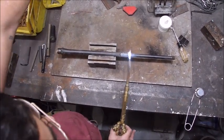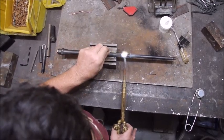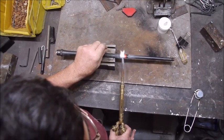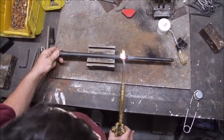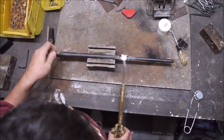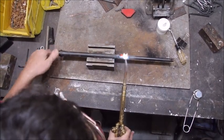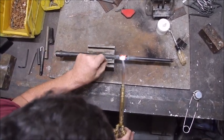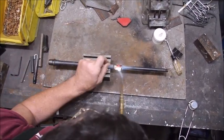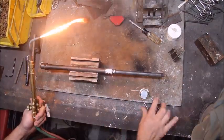So now I'm going to test and see if we're getting enough heat. There we go. Then walk that solder around. It's actually looking a little hotter than I want it to be. I want a dull red, not a cherry red. Looks like that got too hot — I'm really not happy with that. I got it too hot and the solder doesn't stick when it's too hot.